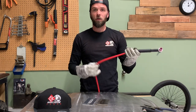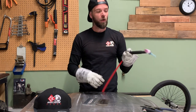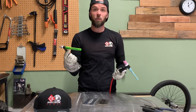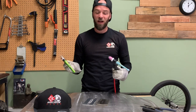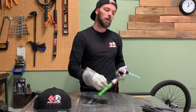We just did two different processes in the span of less than 10 minutes and got good results with what I was looking for - all off one torch lead. We didn't change anything as far as the torch lead itself, we just changed the torch head and the handle. That's the cool thing about these CK lines - they're interchangeable. Especially if you've got wrenches handy right next to you, you can have these guys switched out and be running a different process in a matter of minutes. It's pretty sweet, it's worth the money.